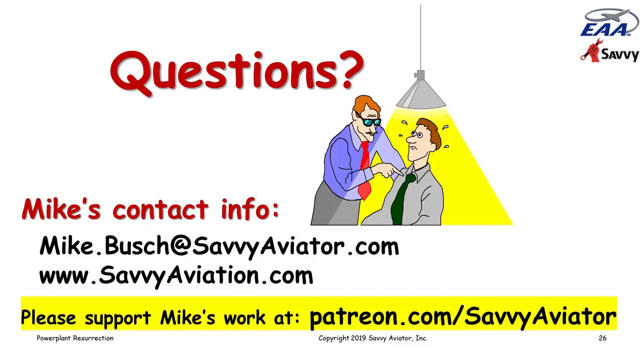Well, let's try and get a couple more questions in here, Mike. Walt's wondering, are any of the accessories like the vacuum pump prone to damage from non-use? The vacuum pumps, they really don't have a corrosion problem. They're built of non-ferrous metal and of graphite. What they have a big problem with is getting any sort of liquid in them. You got to keep them absolutely bone dry.